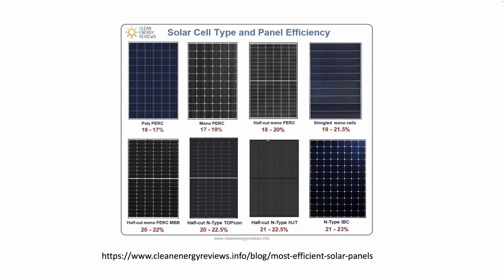Polycrystalline — if you go to Home Depot and buy plywood, it's several thin sheets of wood glued together to give you a very strong material. Oriented strand board, or OSB, is basically chunks of wood pieces glued together. Polycrystalline panels are the same way. When they build a silicon ingot and slice it, they get round pieces. High-efficiency monocrystalline panels will actually have circular solar cells, the most efficient format. However, they're not as affordable. A lot of times they compress the crystalline pieces together — if you look at it at an angle, it looks like broken pieces of silicon squished together, much like OSB.